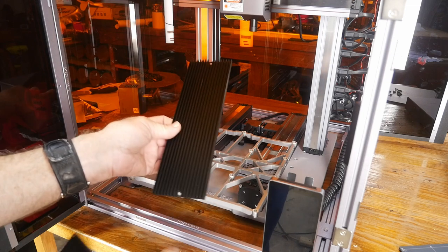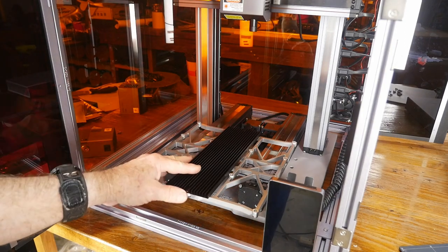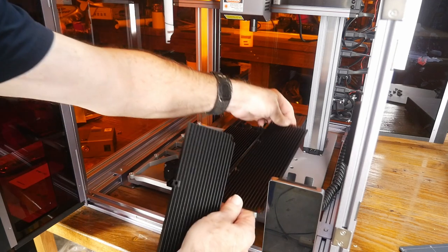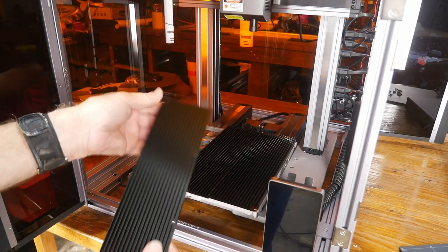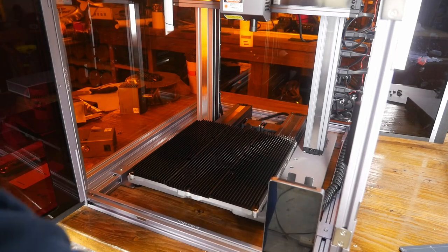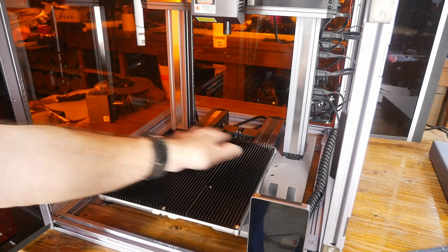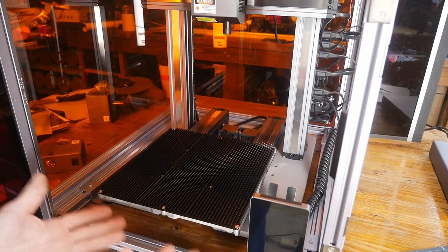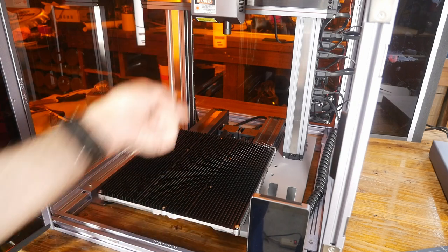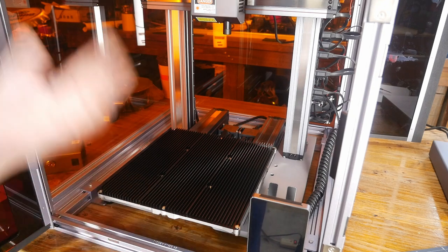Here are your laser plates — shouldn't be any confusion. The center piece has just the two center holes and locates in the middle. The top and bottom corner pieces have two holes each, and the outer pieces have two holes on the outside and two on the inside. After just a couple of minutes the new pieces are in place with the screws in. This is your working surface for the laser — the board sits on top, and we'll use blue painter's tape to hold it in place while we run the laser.